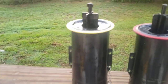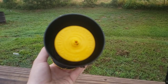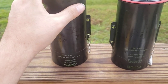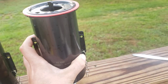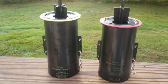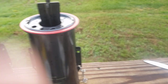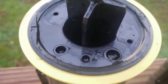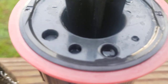This yellow one right here actually says 'aqua piston' on it. I believe these came with the Cimarron, and this more bland canister came with the Wellworth and Highlines. I have found that the yellow one actually stays open a good bit longer than the red one, and I believe that is because if you compare the holes on these, the holes are a lot more restrictive on the yellow one than they are on this red one — you can see that the openings on the red are a bit larger.